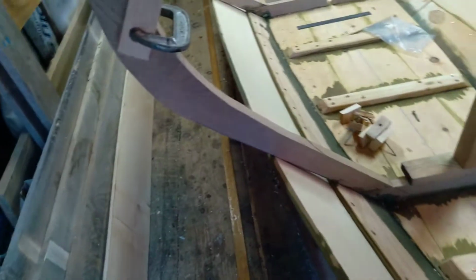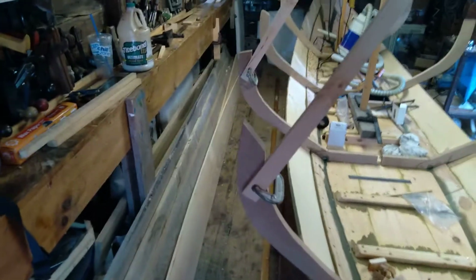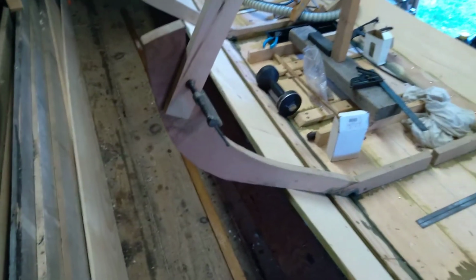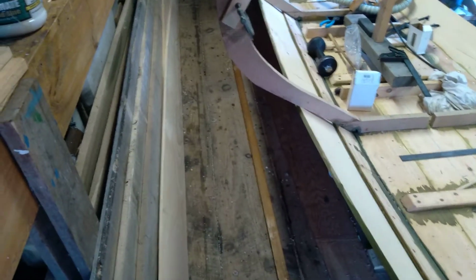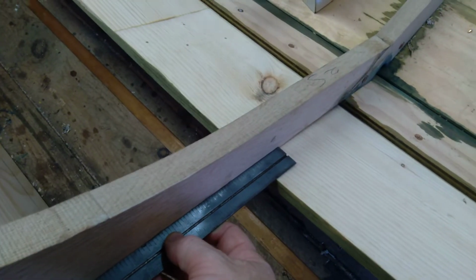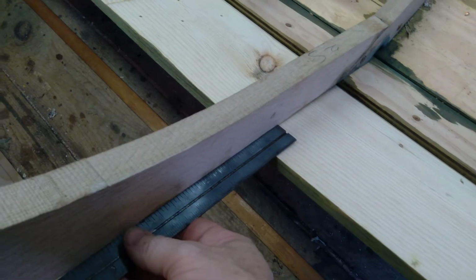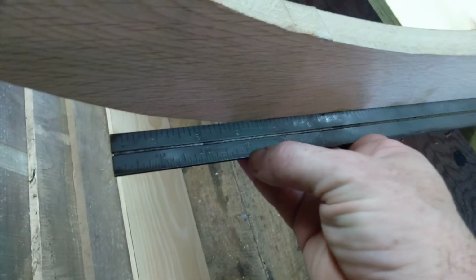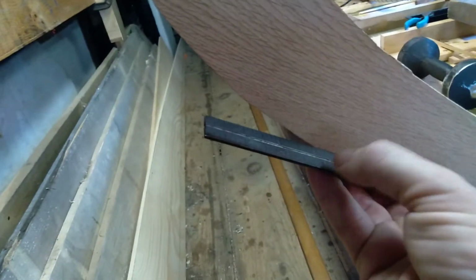All right, so what we need to do to get the shape of this next strake, number 2 strake, is to figure out how much room approximately we want to make up on these frames until the chine, the second chine, the turn of the frame, where there's those frame knuckles. So, it's pretty simple here. Just put a ruler on and I set it in 1.25 inches for the overlap, which I'm going to have on every board. And then about here, so we're at 9 inches. Where my thumb is, 9 inches.